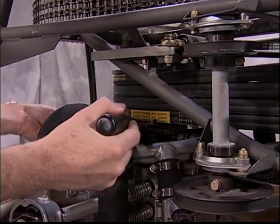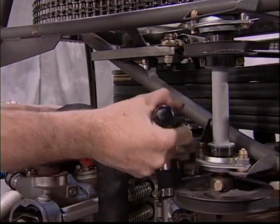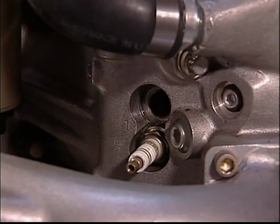Access the flywheel from the pilot side. Disconnect the tank heat shield and use the flywheel tool to rotate the engine counterclockwise as shown. You may also remove one spark plug from each cylinder to allow the engine to turn easier.